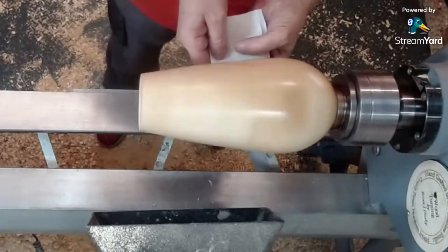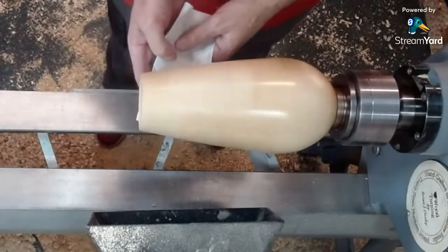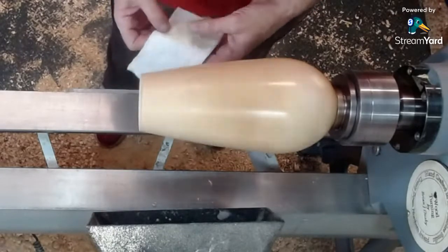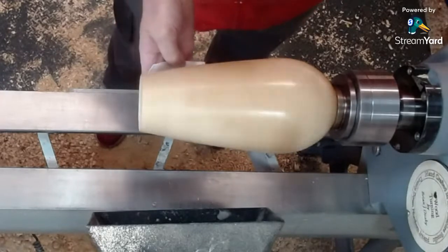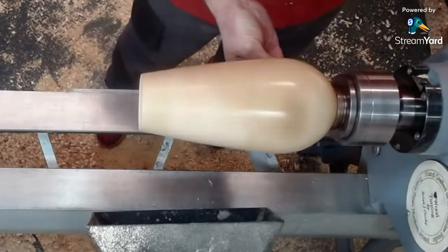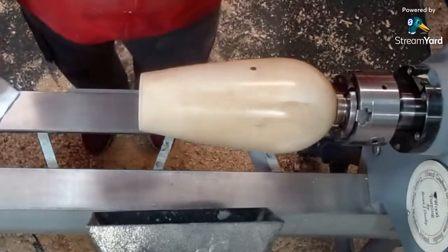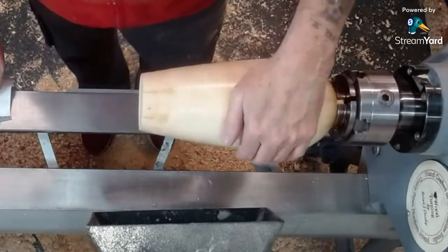And I didn't find it worked. It doesn't soak in, so it can reduce the stain on the top, because it doesn't soak in around the split. It goes down through the split. But as I said earlier, my method is to CA it before you finish cutting it, and then you cut the surface of the CA off. But it's always going to be there. You mean I need to cut that again? Is that what you're telling me? Yeah, cut another 2 mil off of that and that will hide it.